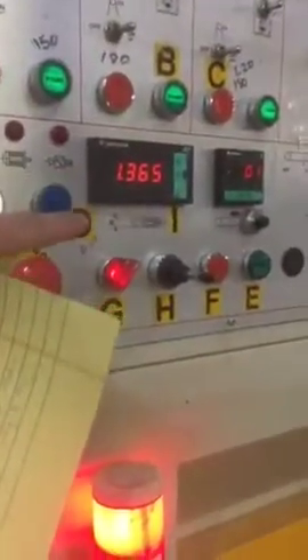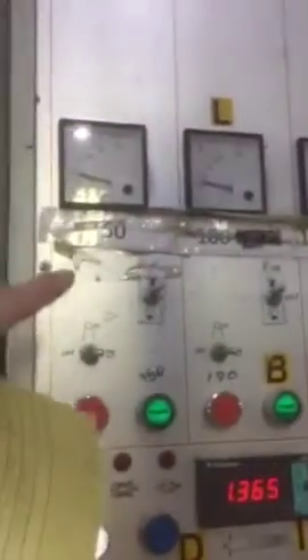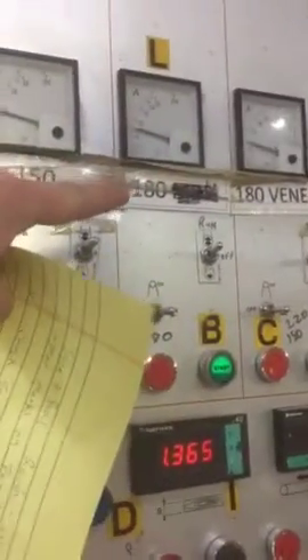Since this is the very first sanding on the door, this machine is going to run a little bit wider for the gapping and a little bit slower when it goes through. Primarily on all hardwood pieces, we're running our 150 grit and then our 180 grit.